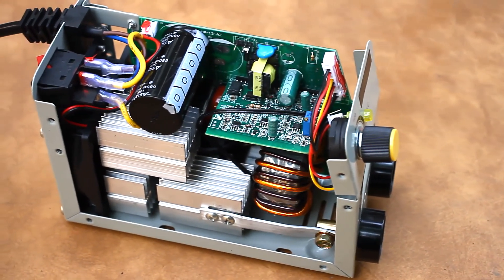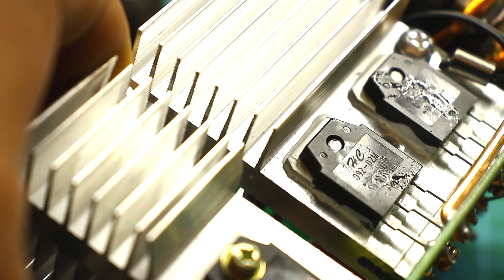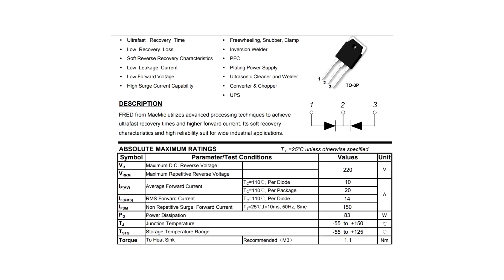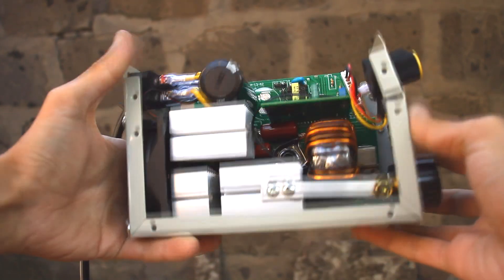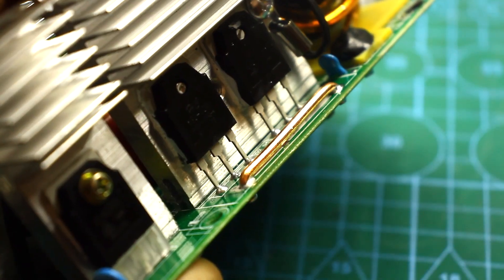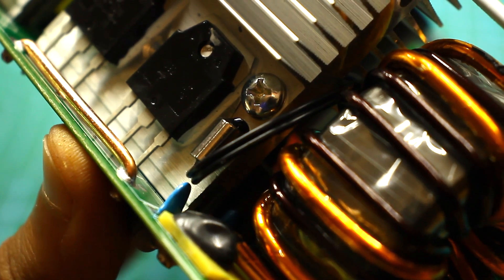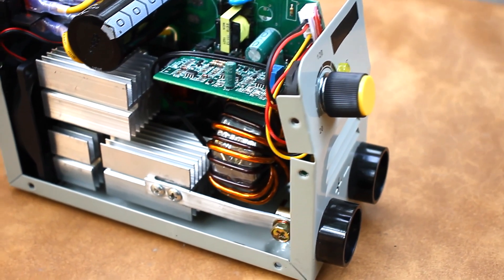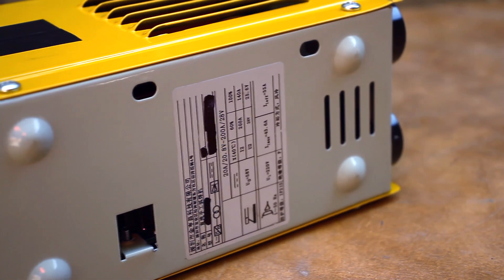The output rectifier is classic — full wave with a midpoint, consisting of diode D9202. There are in total 4 diodes connected as 2 assemblies in parallel. These are diode assemblies with a common cathode, ultrafast, with a reverse voltage of 220 volts and a current of 20 amperes. They are good. On the board there is reinforcement of the power tracks with additional copper wires of a decent diameter. The temperature sensor is mounted on the radiator of the output rectifier, as it is the rectifier that will heat up the most. The input diode bridge is rated for 25 amperes with a reverse voltage of 1 kV — for such an inverter it works, although it could be better.